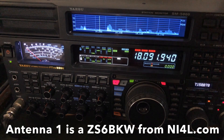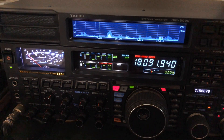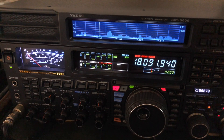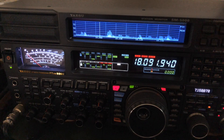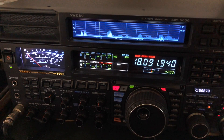You've heard me talk about that one a lot on the channel — in fact I've given one away. There he is. Now I'm going to switch back over to the doublet. See, we're losing him. Back to Antenna 1, which is the ZS6BKW. Why is that? The noise floor goes down. That's him, KX0R. There's the doublet — a little more noise floor, but less of him. Interesting, isn't it?